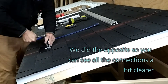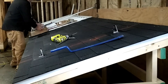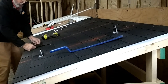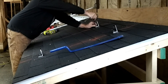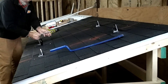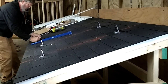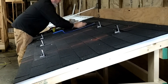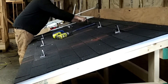Regarding the spacing of the footers: on a 16-inch on-center roof, typically you're going to place the footers on every other rafter. If it's a 24-inch on-center roof system, then you'll probably be putting your footers on every rafter. While you're up on the roof, follow all safety procedures. If you're in a place where you can fall 10 feet or more, you're required by OSHA to use a harness and lanyard. You're putting holes in somebody's roof, so try and be careful — don't mess up the roof, keep your tools in good working order, don't drop them since somebody else may be below you, and be cautious with the sealant so you don't drip it all over the place.